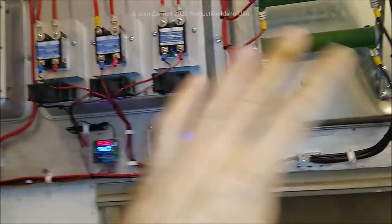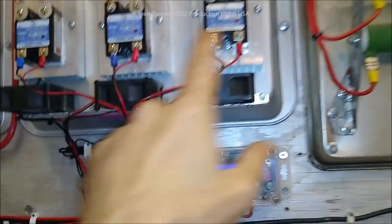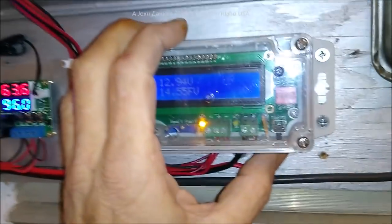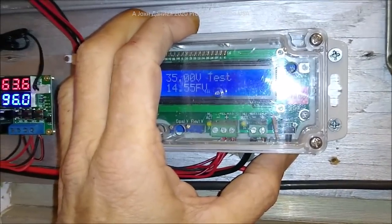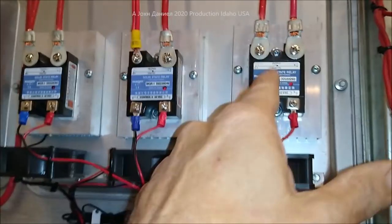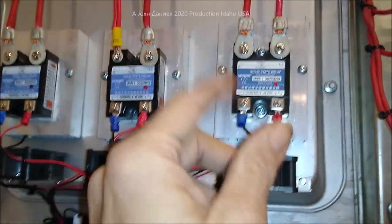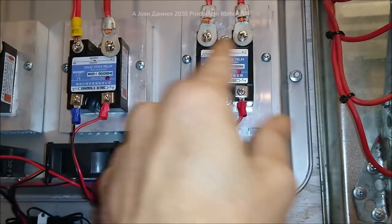You can put 40 wind turbines on one of these because this will run about 50 of these SSRs. Get over here and look — I'm going to hit it to where it's going to go through a cycle. There is its max, there is reset, there is test. I let off test and you are going to see them SSRs blinking. Now, an SSR works by a light signal, what is called a CDS cell. The CDS cell of course operates a set of MOSFETs that turn on and off switching — so there is no physical contact point on it.